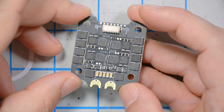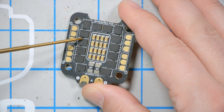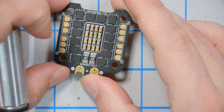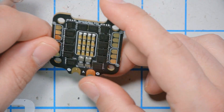Before we get to the main feature, it's worth noting this can also be purchased with a 45-amp 4-in-1 ESC. It has a good number of capacitors, some beefy-looking FETs, and nice sizable motor pads — though they are single-sided, not edge-launch. BLHeli32 ESCs basically all perform similarly at a given amp rating; whether they're reliable or not usually only becomes apparent once they're out in the field.